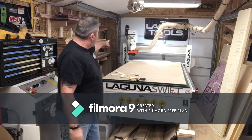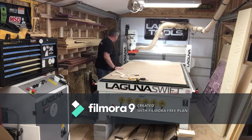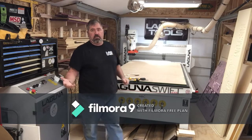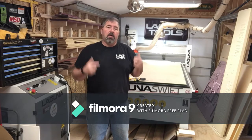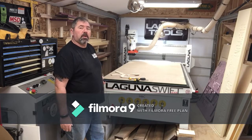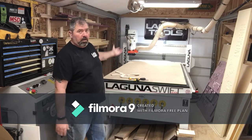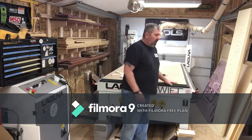So down here is a 3 horsepower liquid-cooled spindle, which, if you're not familiar with CNC, a spindle is just a fancy name for your router. It's literally a 3-horsepower router. Mine happens to be liquid cooled. There's a bucket, literally a bucket, underneath the CNC table. We run RV antifreeze in ours. This is a heated climate controlled shop, but God forbid the power goes out, I don't want to be blowing my router up because it froze. So that's what we use there.